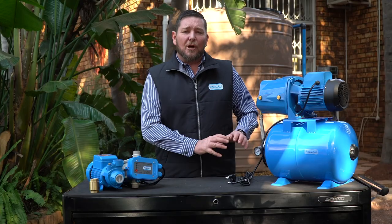When you're catching rainwater, it's best to filter your water before it goes into the tank. It is very bad practice and not recommended to put the filter directly on the inlet of your pump — this will restrict water movement, and therefore the pump will ask for water that it's not getting and will not be able to deliver it. Remember, a pump cannot create water; it can only deliver what it's getting in.